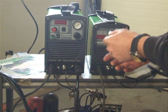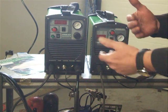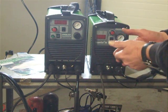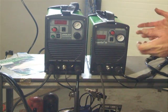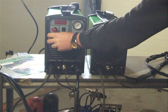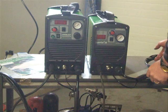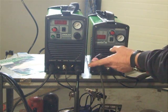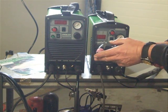The post flow on the Power Plasma 50 is adjustable — unlike some machines set at a fixed five or two-and-a-half seconds. If you're cutting heavy material, you want a lot of air flowing through the torch after the cut to cool it down as quickly as possible. This prevents damage to the torch head and stops your consumables from wearing out too quickly.